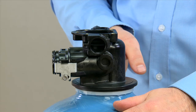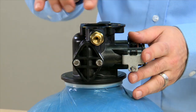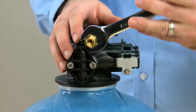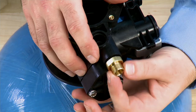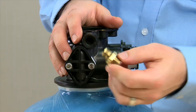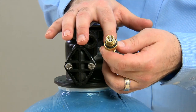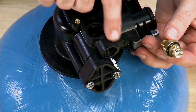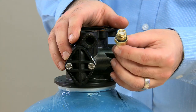After removing the drain, we can then move over to our injection system. The brine line flow control is held in behind this brass nut. This is our standard 1600 system brine line flow control. We have these available in 1/8, 1/4, 1/2, and 1 gallon flows. The sticker on the back of the body will indicate which one your unit originally came with. Make sure to match this.